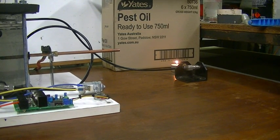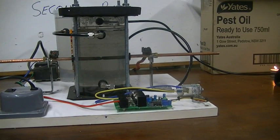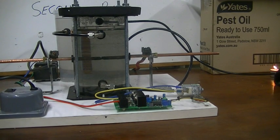There you'll see our candle going there. We're getting a good amount of gas coming out of there, definitely enough to run a small engine. You've got to let the system run for a while first to purge out all the air — otherwise, yes, it went bang. That's when I put the candle in front of the tube; the mixture was too lean, had enough oxygen to flash back up in the tube. But as per design, our little flip lid just popped open and no problem. If I let a bit of gas go through before I put the candle in front of the nozzle, no problem at all.